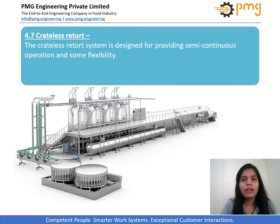Crateless retort. In this retort system, size and configuration are a function of length, speed, can size, cooking requirements, and available space. The system is often up to 270 degrees Fahrenheit, and higher temperatures are available. In the first stage, the retort is filled with cushion water. Cans are then loaded into the retort with a high-speed conveyor which accepts any size without modification. When the retort is fully loaded, the cushion water is replaced by steam and the cans are cooked at the correct pressure and temperature. A water reservoir system, prefabricated piping, central motor control cabinet, and sand filter package are among the options available.